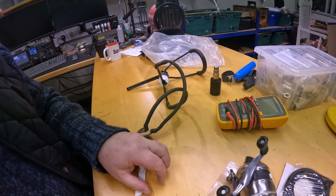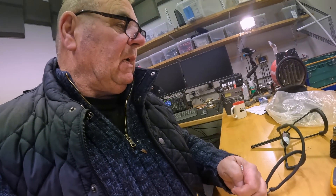In a couple of weeks' time when we put the 160 up — alright, a bit of a dead duck today. I was expecting to have to get soldering irons out and fix all this, but there's no fixing to be done. I mean it's 1.2 SWR on a patch lead — to me that sounds crap, it should be 1.0 to 1, exactly 50 ohms. So is the coax just old and deteriorated — does it need to be thrown away? Does coax age? Let me know in the comments. See you on the next video — adios.